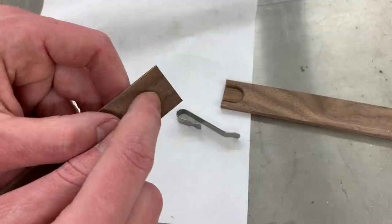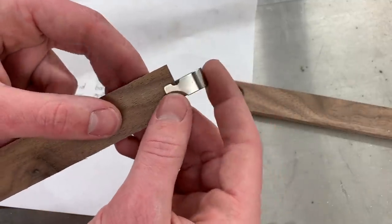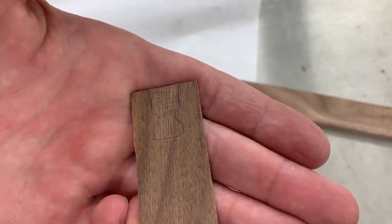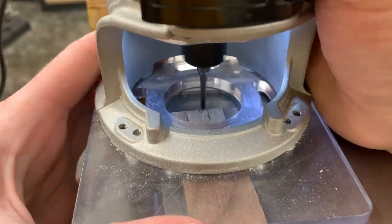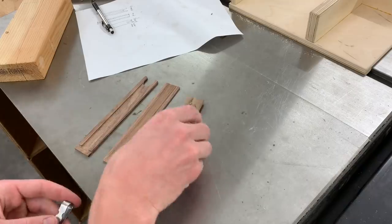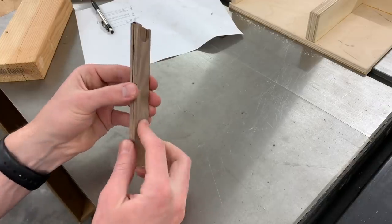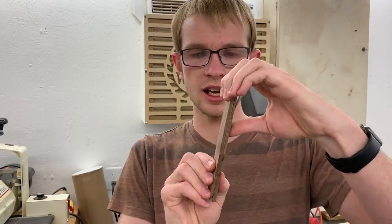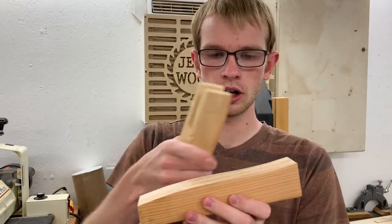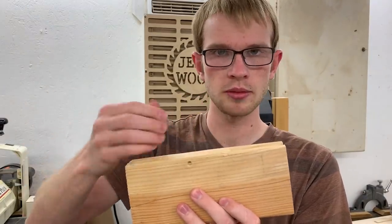In order to draw this cutout onto the back layer, I've just marked where it needs to be, and then I can put the clip on here, make sure it's centered, check the other side to be sure it's straight, and then just trace around that. Now I can cut that out with a router and I know I'll have an exact fit. And just like that, it's all ready to glue together. This is also the step where I give it its S-curve shape — when you glue all three layers and force them into an S-curve as the glue dries, it will retain that S-curve. So in order to make the S-curve initially, I took a 2×4 and cut an S-curve into it. I've actually used this jig already on several of them. There's also a slot cut into it that gives clearance for the clip. I just need to put all of the pieces in here and clamp this together, and that will clamp the S-curve into the sheath.